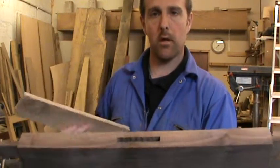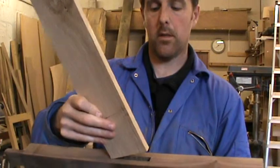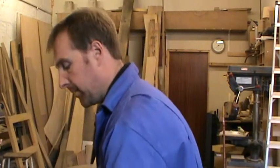You can see the holes there. I still have to sand this down to be a neat fit, but this is going to fit in here. I'll create a mortise on the other side, so I'll be able to fix my mistake and nobody will know.